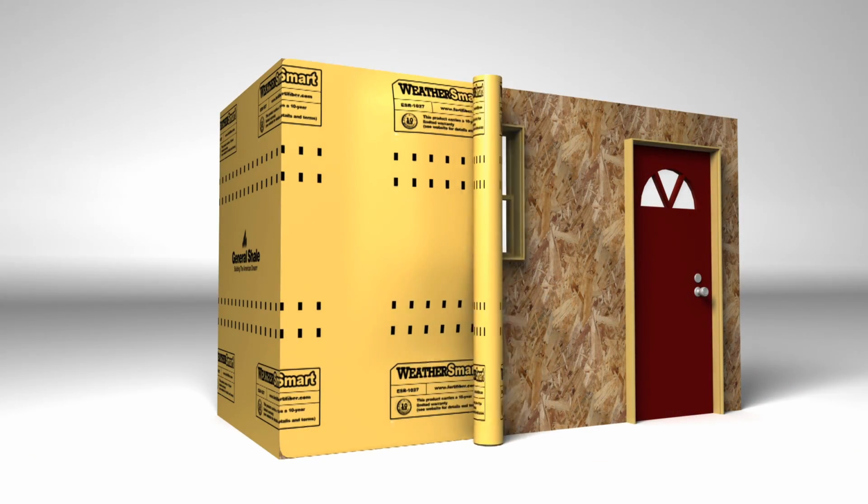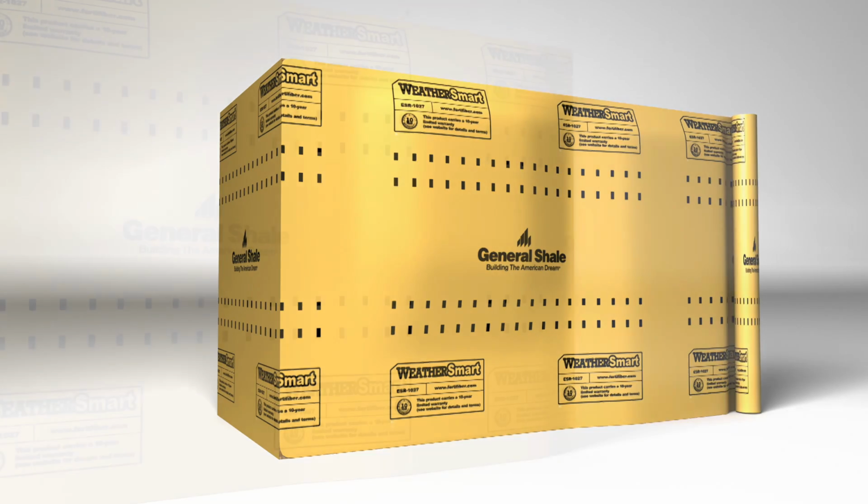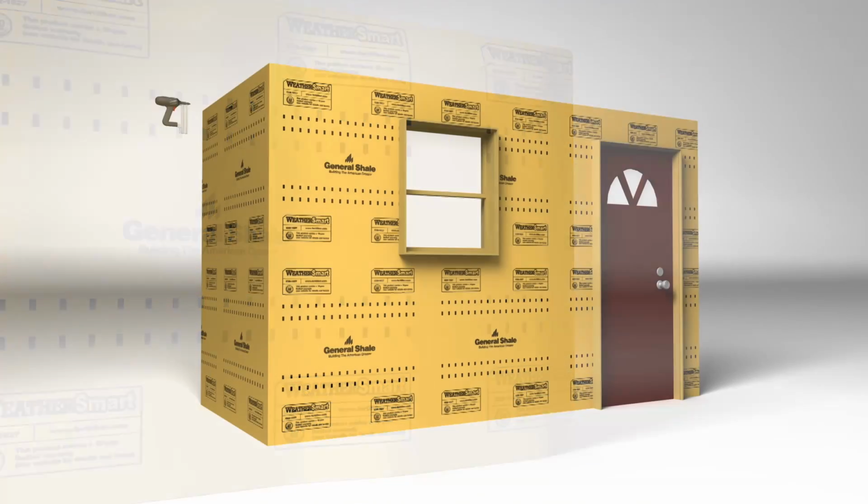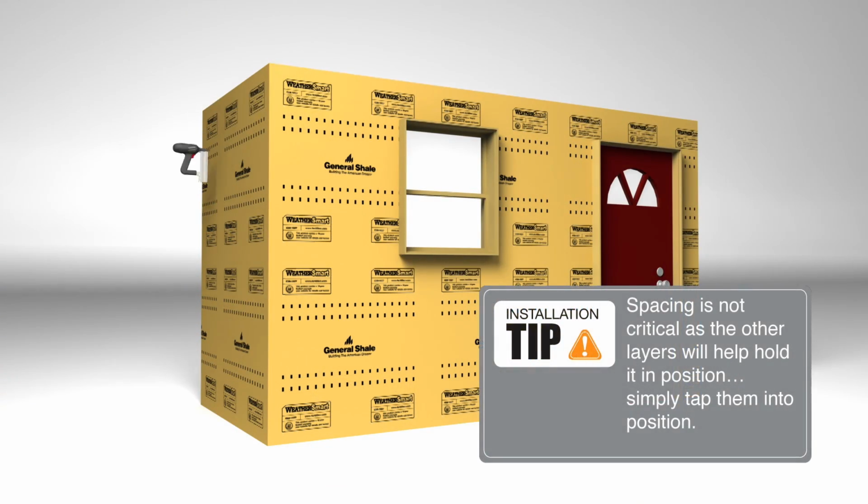Now, let's install the weather-resistant barrier. Then cut out around windows and doors using a box knife. Secure the barrier with approved fasteners with a plastic grommet. Then cut out around windows and doors.